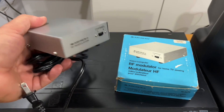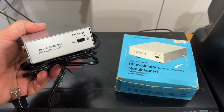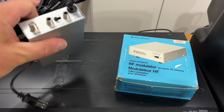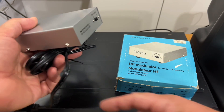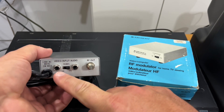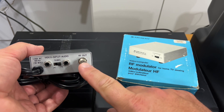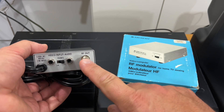Check this out — it's a vintage Radio Shack Archer RF modulator. Some of you might remember these things. They had their heyday quite a while ago. An RF modulator takes an AV video signal — the RCA video and audio plugs — and turns it into an RF TV channel, so you can run this right through coax cable.